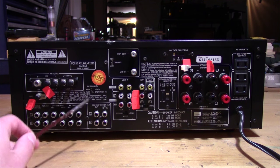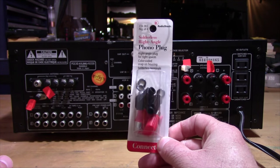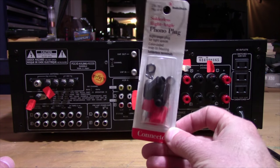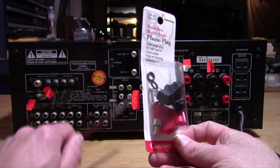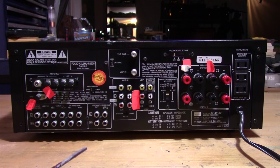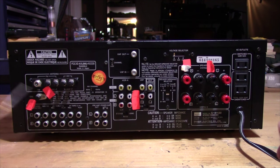So what I have to do is make some jumper cables. I could have bought them on eBay, but I have the means to make them. I bought these angled RCA connectors a while ago for another project — I'd have to finagle them around a little bit, but they'll save me time. I've got some heavy gauge speaker wire; I'll cut it to length, solder it into the center pin, plug them in, and we'll have our necessary preamp jumpers. Before I do that, though, I can actually just jumper this across with a standard six-foot RCA cable — there might be some signal loss, but it would be good enough for a test. That's what we're going to do first.